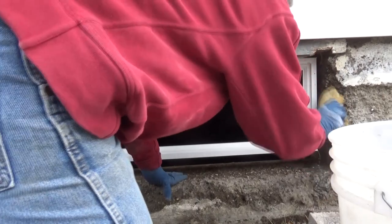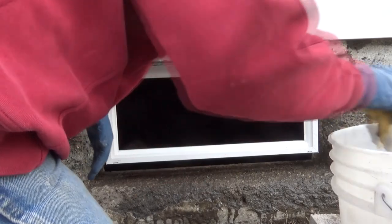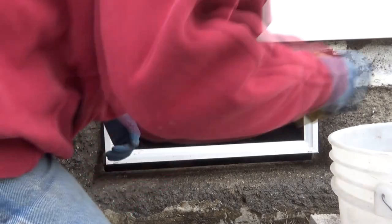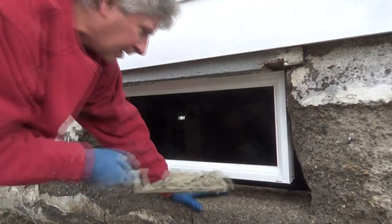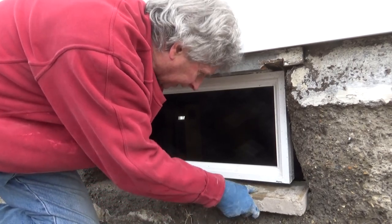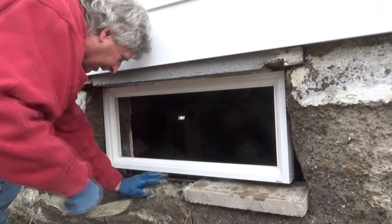I'm going to wash this down. You've always got to clean it and wet it first, or it's not going to stick — it's an old foundation. Wet this off first, clean that off. I've got it over to the window — yeah, it's wet in there so that's good. Let me get our block work in like that, just like that. No big deal — use your hands; you don't have time for a trough.